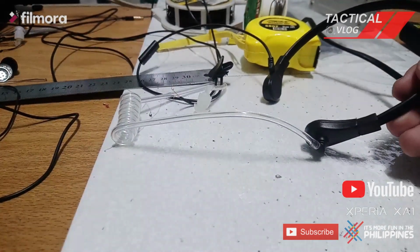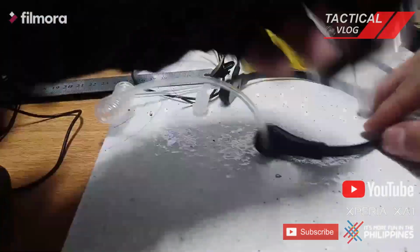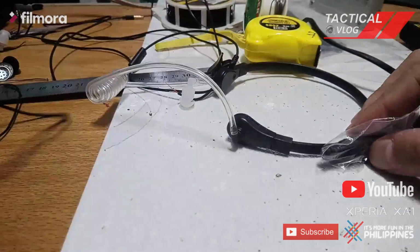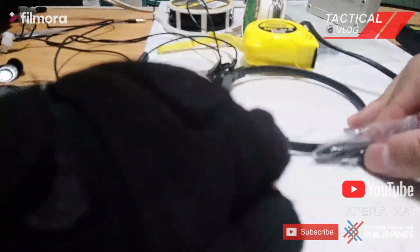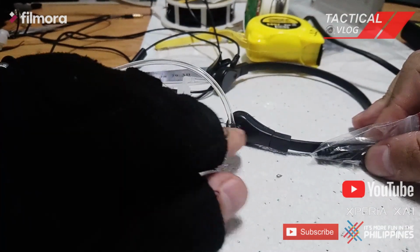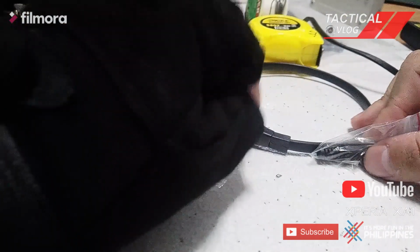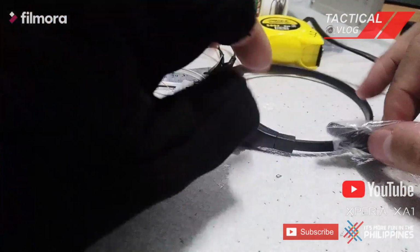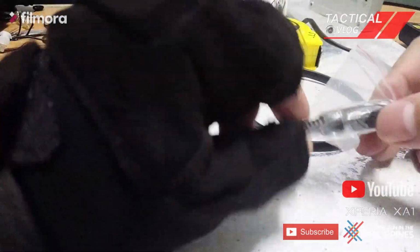So what I'm going to do is I'm gonna try to connect this 3.5 female plug on this side using the spare wire that I cut from this earpiece. So I'm gonna make a wire going all the way here, so that's more like an extension. Actually this one I could still use. There was a speaker on this side inside of this portion, so I just need to remove the screw so that I could wire this plug so that it can be connected on the D-shaped throat mic.